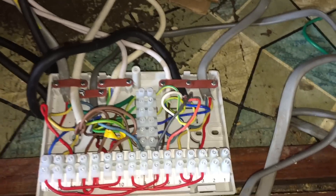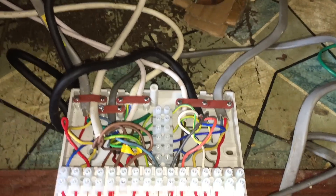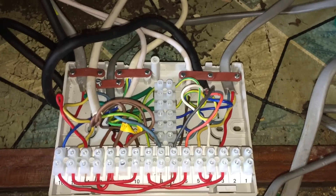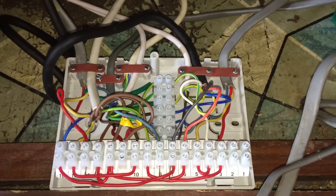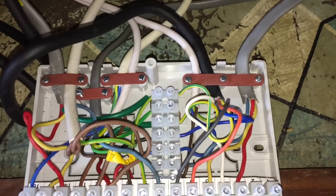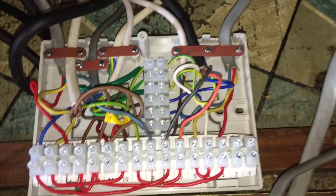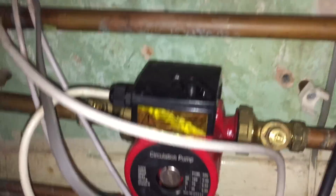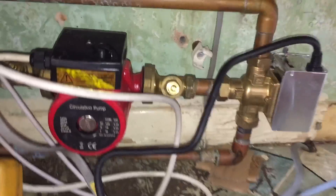White to blue — now one volt. Boiler's just closed down. So everything here is working electronically, working as it should. I'll just get this back together, and then I'm going to deal with the complaint. The reason I've checked the wiring on this job is this has been an ongoing electrical issue with fuses blowing, and someone's rewired this recently — apparently that has fixed that side of things. So let's just find out what's going on with the lady's heating now.